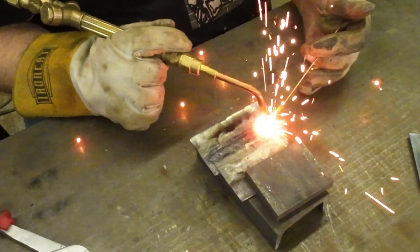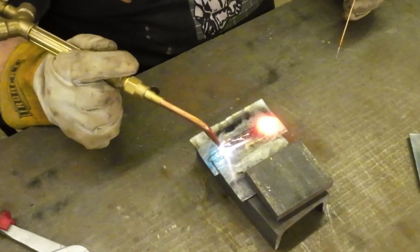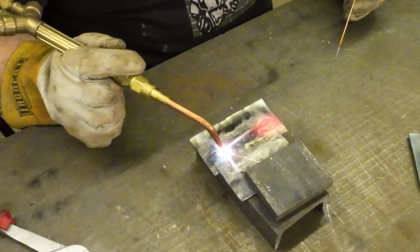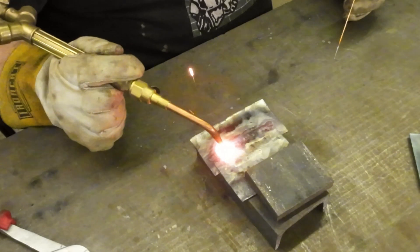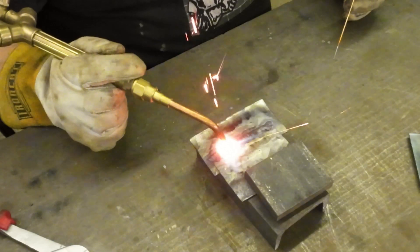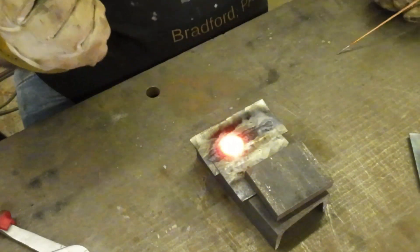You can see she's starting to really heat up. Now if I saw a bad spot I could actually go back over it and get my puddle back, then just start working that puddle again. That's why I always say it's sort of like TIG — especially like when I was doing that gas tank. If I had any bad spots I could always go right back over them without having to grind anything out.